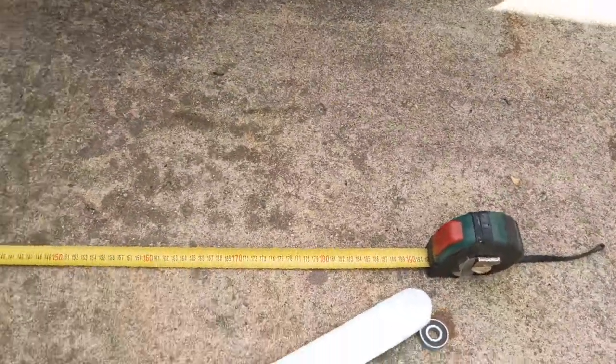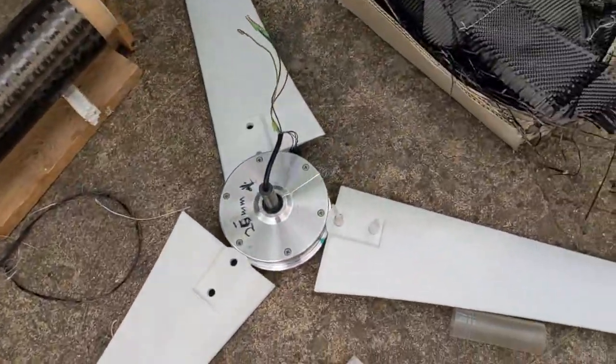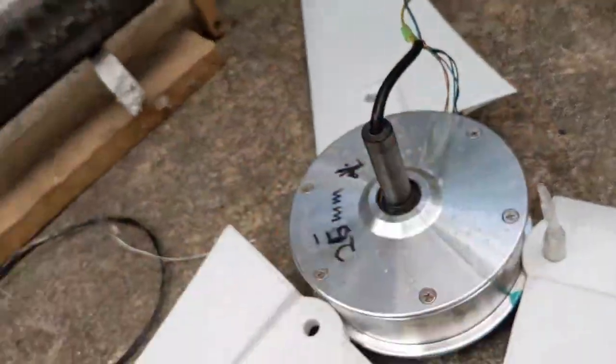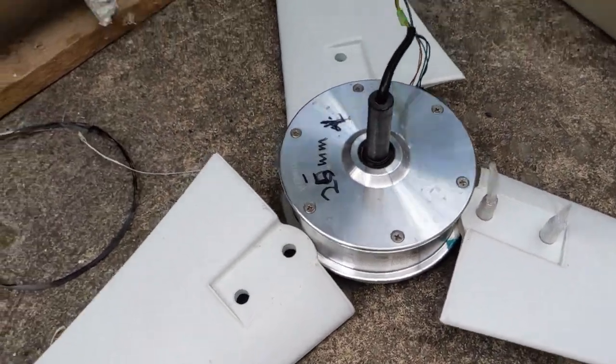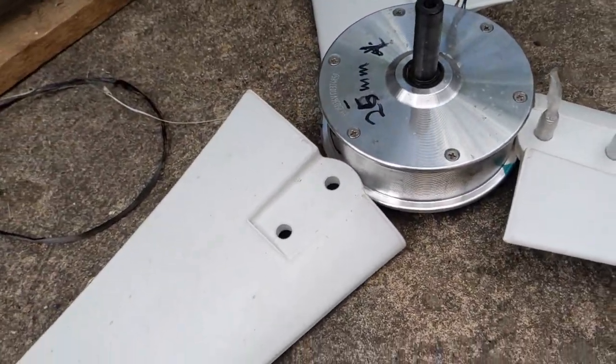The spacing is simply the same distance for all three blades, making it easy to put the blades in place. You could make a six-blade version — six blades give more torque so it starts at low wind — but lower RPMs means lower voltage, and then you can no longer charge a 24-volt battery. Three blades is the right balance and is also the most economical.